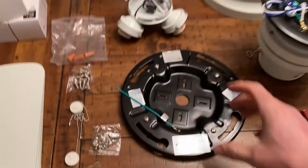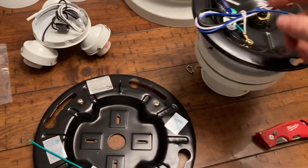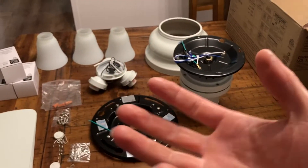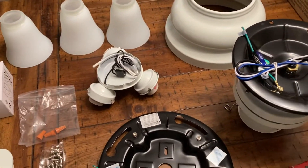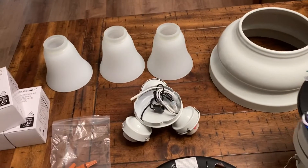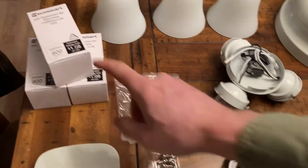So this is the mounting bracket — this screws to your light fixture box that's in the ceiling. Then you can mount the next portion, sliding this little square hole onto the little hook, and I'll show you how to do that later. That way it holds it while you wire all the wires together, because it used to be where you'd hold it with one hand and wire with the other, which was a pain. This is the shroud that covers it, and it's optional to have lights or no lights. You remove the bottom cap and put on this cap here, which has the light bulbs, then install the light bulbs inside.